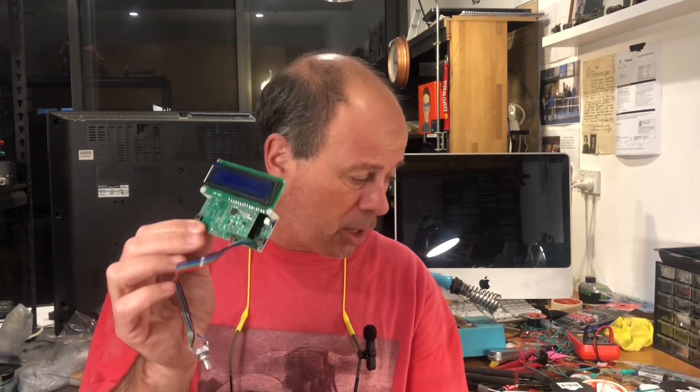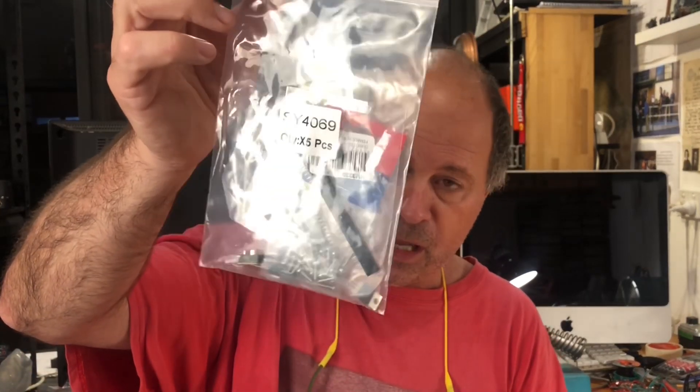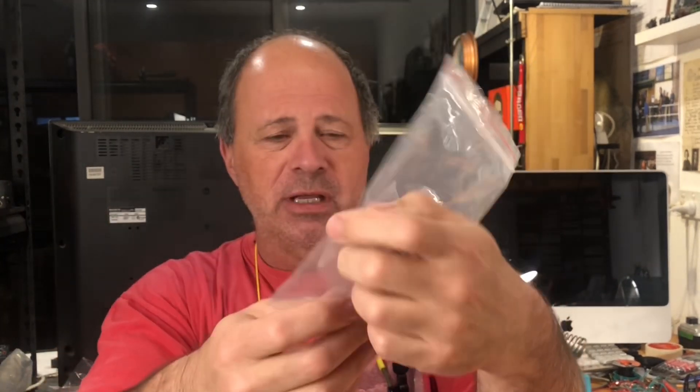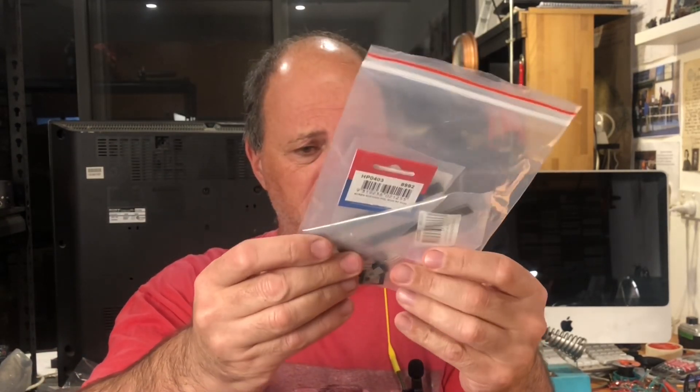The plan is now to apply power to this. I had a three-pin regulator I was using in a breadboard, and because it had been plugged in and out so many times the legs were very weak. While I was trying to apply it to the board the pin broke off and I didn't have enough pin left to solder to, so I was left without a five-volt regulator. We went off to Jaycar Electronics — I had a ten-dollar credit so it felt cheaper than it really was — and got some nine-volt and five-volt three-pin regulators, some headers, and a 3.5mm stereo jack, which I'm going to use to perhaps make my AOE Monster a 50-watt transmitter using the QRP Labs amplifier.